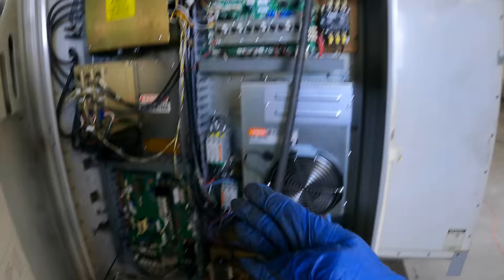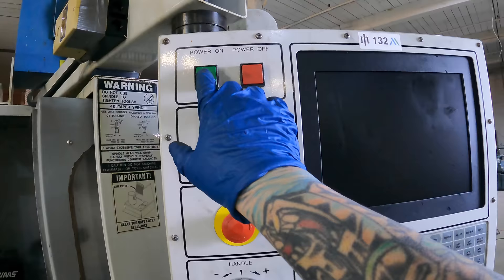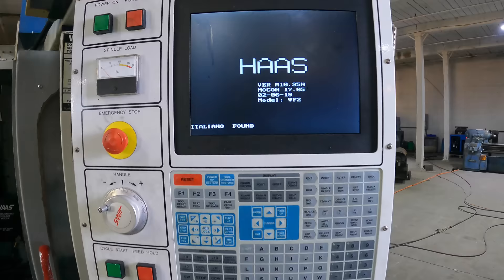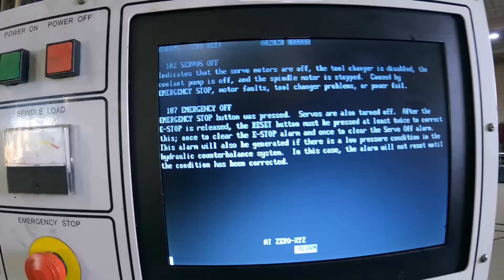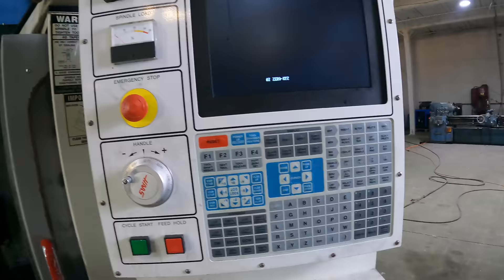We got power, we got air. Let's throw the switch and see what happens. Nothing's on back here yet. I can't remember with the Haas — I think you have to turn everything on from the button. There we go — it's loading up. Alarm. Servos are off — indicates that the servo motors are off. The tool changer is disabled. The coolant pump is off. Called by emergency stop. So that's obviously in. Let's reset that. Servos are off. No alarm.